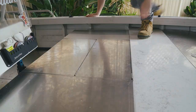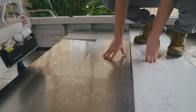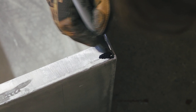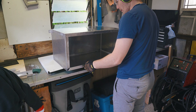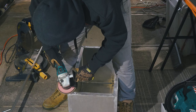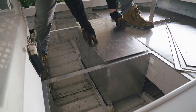I mentioned in the previous livewell build video that I needed to add an additional perimeter to the livewell tank, as the flex of the panel at the front wasn't ideal. Unbolting the livewell tank and the centre hatch module was pretty effortless. You shouldn't use an abrasive wheel on aluminium as it gums up quickly, or worse, jams and shatters the disc — I purchased a diamond edge blade designed for aluminium and used copious amounts of WD-40 to lubricate the cut. A new length of extrusion was welded to the inside lip of the tank, completing a full return lip perimeter using 25mm extrusion. A flush top surface is necessary for the hatch lid to sit flat and to ensure a good and mostly watertight seal to the livewell.